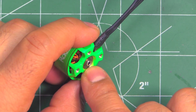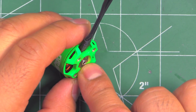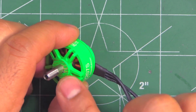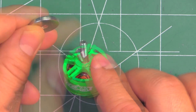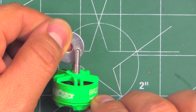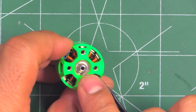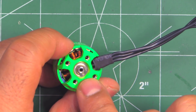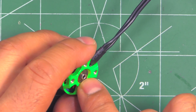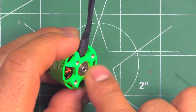We'll find out soon enough when people start using them — we'll see how durable those bearings are. It's got a few newer features: they say it's a stainless steel shaft. Stainless is not magnetic, so it is stainless steel because it's not magnetic — that's good. Hopefully it is hardened steel and it is hollow all the way through. They're still using a circlip to retain the shaft, not an Allen screw, which would be much easier to remove.